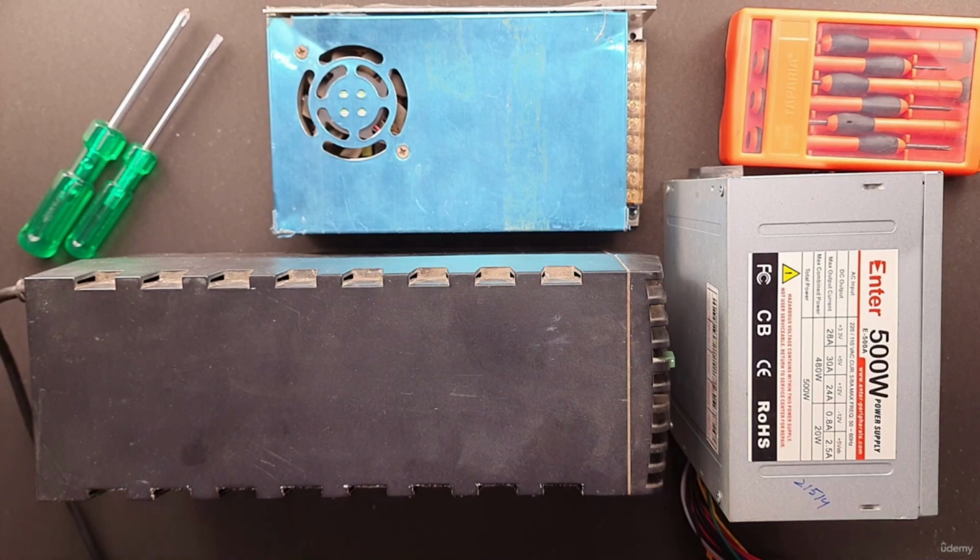Now remove everything before you go for the screws: battery covers, rubbers, cover jack. If it comes off, take it off. And never force anything. If the case won't come apart or some corner seems stuck, there's a reason behind it. Perhaps some snaps are hiding on the inside of the plastic.